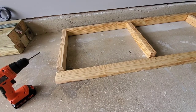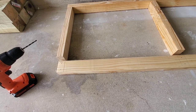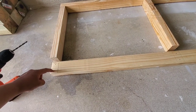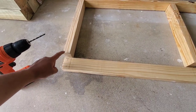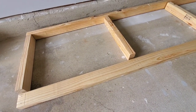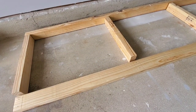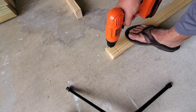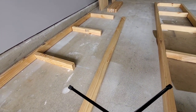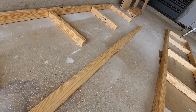I'll be using a circular saw — I don't own a table saw, I'm just a handyman. Every 24 inches I'll be using supporting 2x3s on the long 2x3s to create the base. I'm gonna pre-drill two holes for each and then mount them and put the screw in, so it should give them a nice support. Let's start drilling on this whole 2x3 piece. Now that we've got all the screws preset, let's start mounting the base.